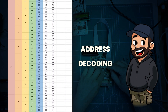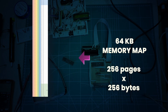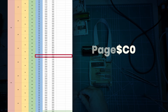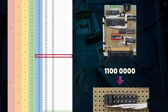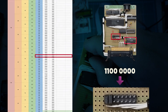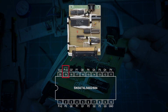Each module in SEBA1 is assigned a 256-byte slot in the 64-kilobyte address space, also known as a memory page. For example, if the CPU is accessing address C012, the high byte is C0 — in binary, that's 11 followed by 6 zeros. With jumpers, I can set a fixed 8-bit pattern like that, and the 74LS684 comparator continuously checks whether the CPU's high byte matches it. If they do match, the comparator outputs a logic low, enabling the module to respond to the CPU.